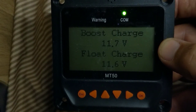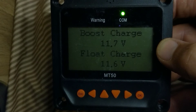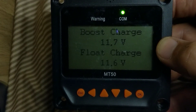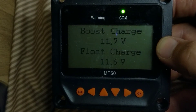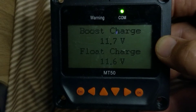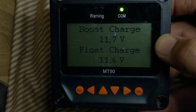This video shows you how to reprogram your HymerActive solar controller so that it can't charge the Ecotrek batteries. The goal is to get both the charge voltages below 12 volts, which is lower than the Ecotrek will accept, so that's fine.